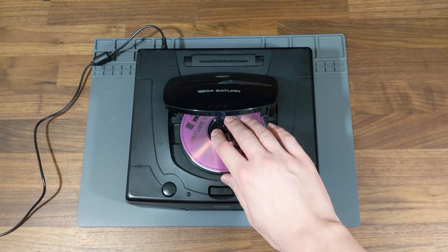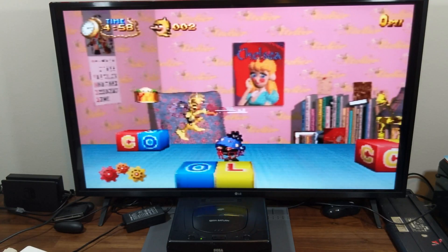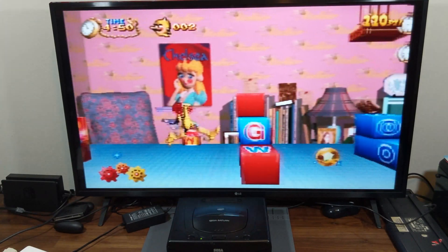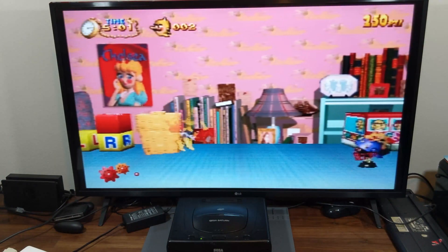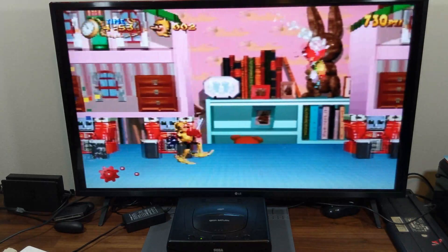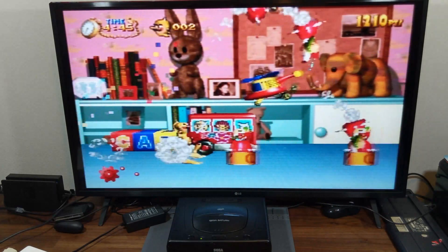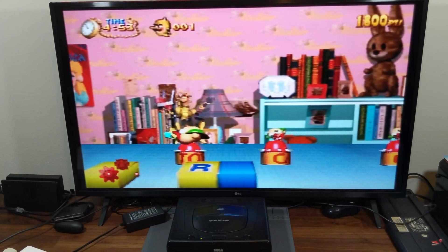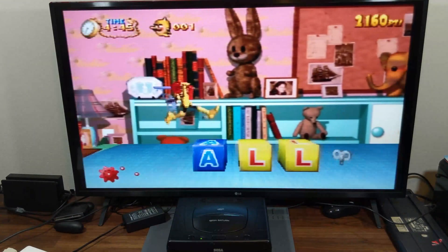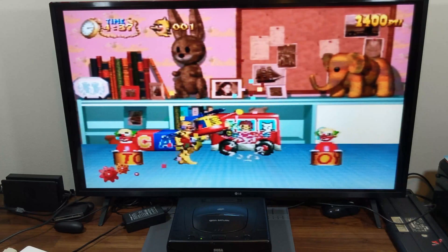The hard part was out of the way, so I popped in a game and went over my thoughts. The ReSaturn works very well and is likely leagues safer than the stock Sega power supply. It uses a standard off-the-shelf 12-volt AC to DC adapter as its input, which means you won't need to track down any special cables should you need to replace your adapter. The installation process was an absolute breeze, and Rexus's instructions provide plenty of detail for those who might be unfamiliar with electronics, the Saturn, or both. The ReSaturn costs 36 British pounds, which converts to about 45 US dollars at the time this video was made. This price could seem steep considering you will also need to purchase an external AC adapter, but the quality of the product speaks for itself and you would be hard pressed to find a replacement Saturn power supply otherwise. A used Saturn can go for 60 to several hundred dollars depending on condition, and the 20-year-old power supplies in these units will likely need replacing at some point, which makes replacing the power supply in a Saturn you already own cheaper in a lot of cases.